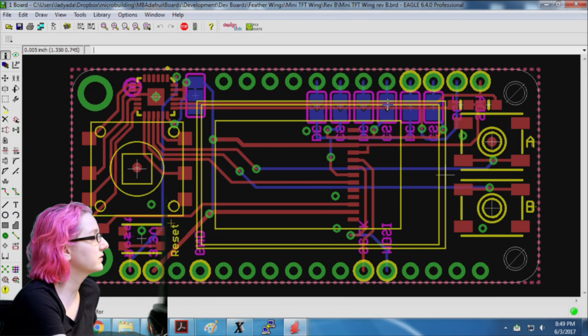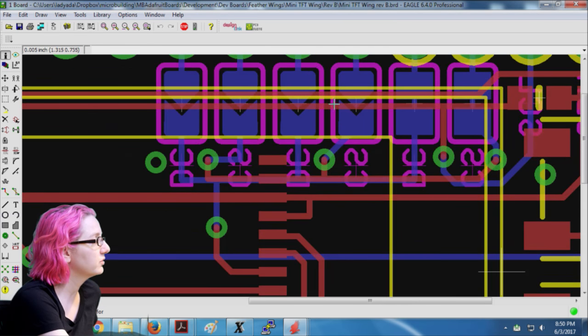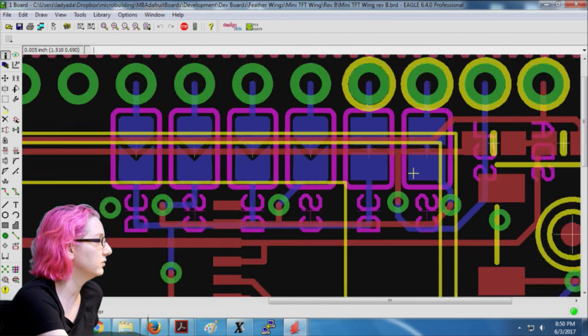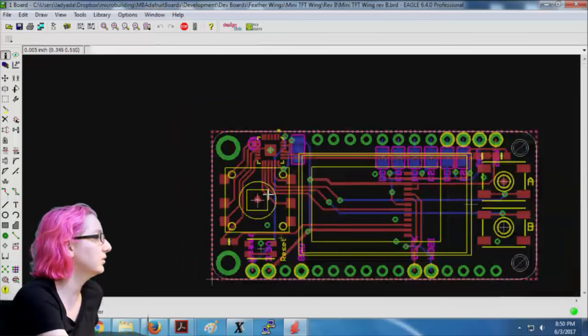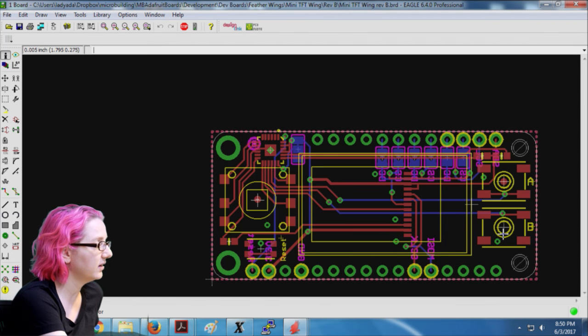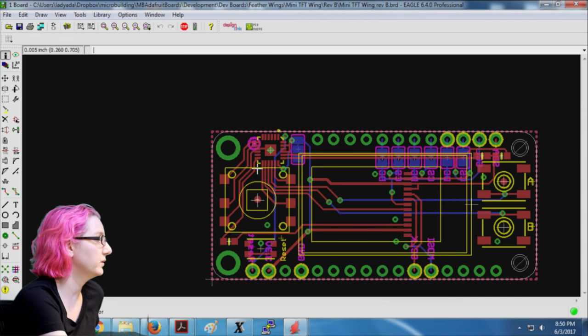One of the things I did — I have to use MOSI and SCLK because this is SPI and you have to use hardware SPI. I made it so you can have software or hardware jumpers for ChipSelect and DC. These are closed and these other two sets are open. For the reset pin, I actually put it through an IO Expander, and so did the buttons as well. There are four directional buttons and press-in, so five buttons total, then six, seven.